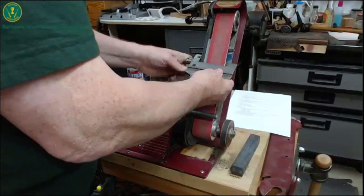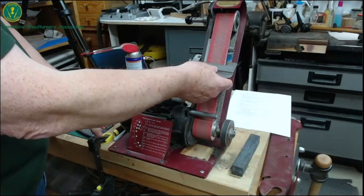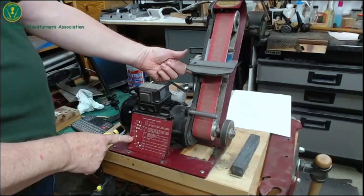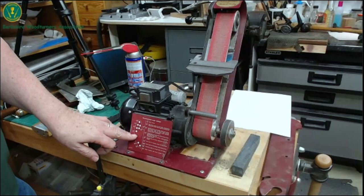I'm now going to do a 45 degree grind — that's the 1, 2, 3, fourth hole. It's quite easy to find which hole because it's the last of a set of four, with quite a big gap on the side to the next one at 60 degrees. Someone mentioned drilling in the side to maybe get a 50 or 40 degree for the 40-40 grind — it would be interesting to try.